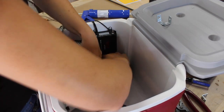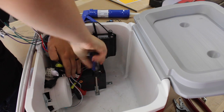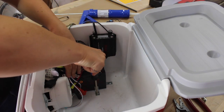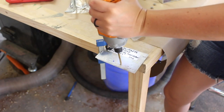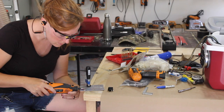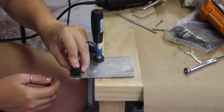After doing a preliminary hookup to make sure everything was working, I started mounting everything permanently. I'm fixing the battery with two right-angle brackets; however, they're not attached to the battery, just the cooler, to keep it in place. Something completely optional but that I wanted to do was add a switch to completely interrupt ground and turn the components off inside the cooler, so it's not drawing any current whatsoever and slowly draining the battery.